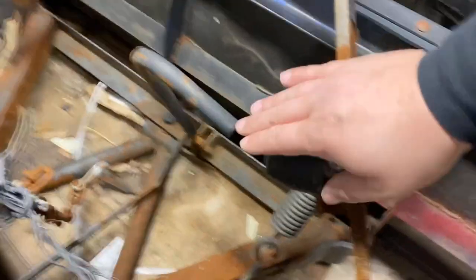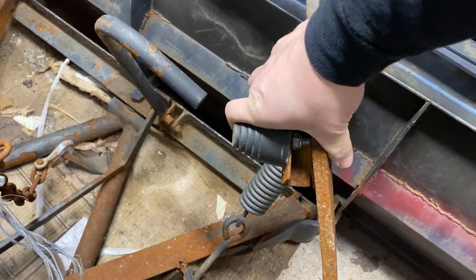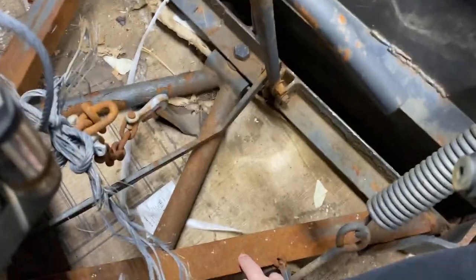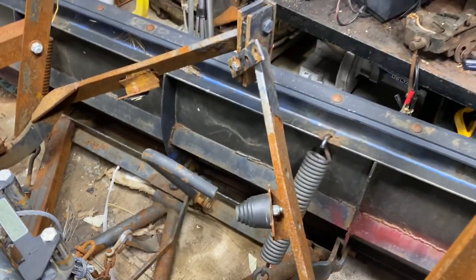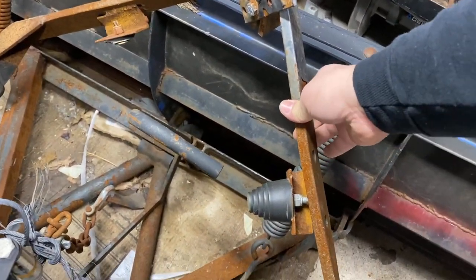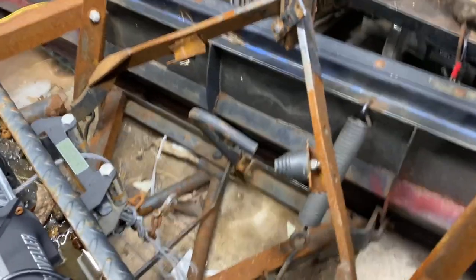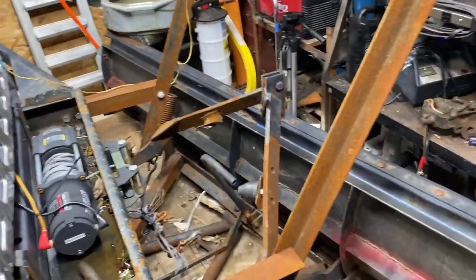And these bump stops, when I fix them, I'll tell you about these. Well, screw it, I'll tell you about it now. The bump stops are here based upon the fact that that's actually what my plow sits on. These angles hit here when it's fixed, though it's all bent up now, so that the plow doesn't go back and forth and doesn't break my winch wire like it did. It would hit tight on the A-arm, I guess I'll call it, and it would snap the winch cable because of the tension. But anyway, that's, again, a high-level build of the plow system.